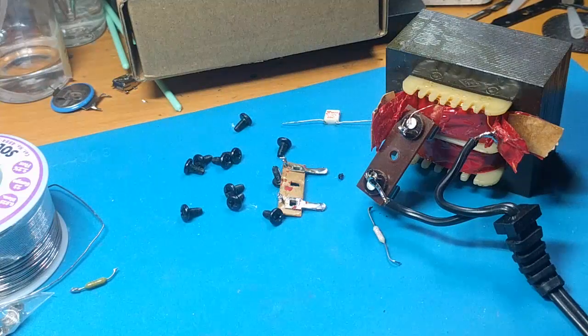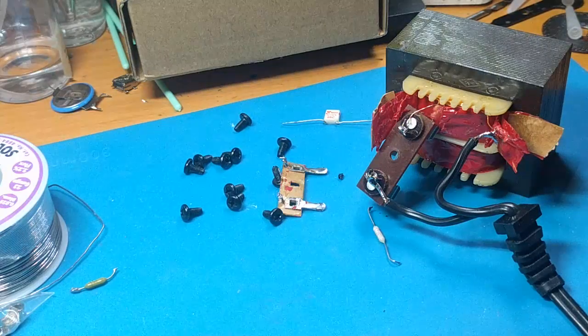In fact, my newest mixer is a Yamaha, and I bought it specifically because it uses a 12 volt DC power supply, and it's small with a couple of features. It's called the MG06X. That's my current mixer. It doesn't have those nice fader knobs. It's much cheaper, but it runs off 12 volts DC, which means I will never have these kinds of problems with it. Avoid things that have specialized AC brick power supplies. It's really annoying to have to try to source super rare, weird, custom power supplies like this.